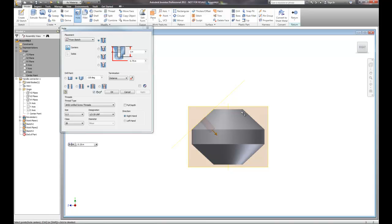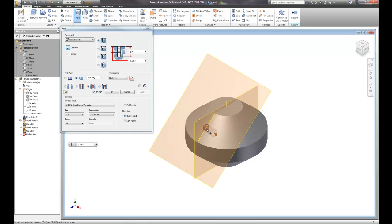There's a shaft that goes through here, and so we might have to actually just drill a hole through the center also. We're going to make it a half inch unified national fine thread. One inch deep actually worked out pretty well.